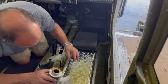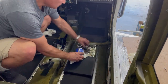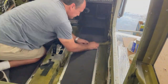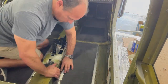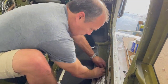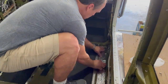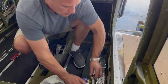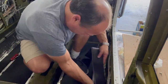The last two steps I didn't film: it's just wrapping the carpet around the wingspar, and we talked about how that gets secured in place without needing any glue or anything like that. And then that center strip where your flap handle is actually has four snaps — they snap down in place because that way you can take that off and put it back on during the annual. If your airplane doesn't have the little snap receptacles on the other side, that's okay — they supply those. Basically it's a screw head that has the male side of the snap on it, and you screw that down in place of some of the screws you may already have on that center console. Then on the carpet itself is the female side of the snap, so you just snap it down in four places as you'll see in the pictures.